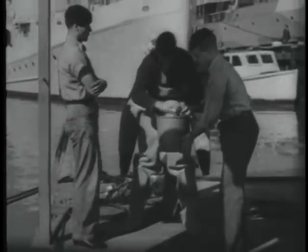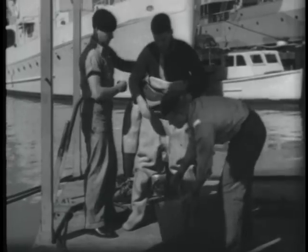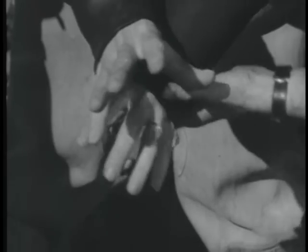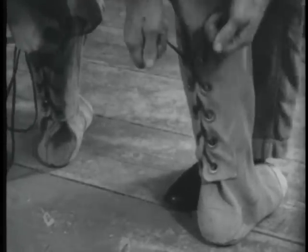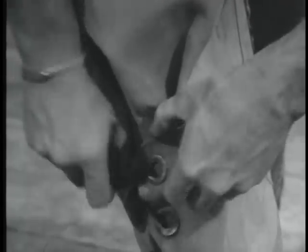If the dress has cuffs, the diver should dip his hands in soap suds before placing his arms in the sleeves so that his hands will slide into the cuffs. The diver now holds the crotch of the dress up as far as possible while each tender laces one of the legs. Under no circumstances should lacing be avoided, as has occasionally been practiced, since it is an important factor in making the diver stable by preventing the legs from inflating. Lacing should be carefully tucked behind the flaps.